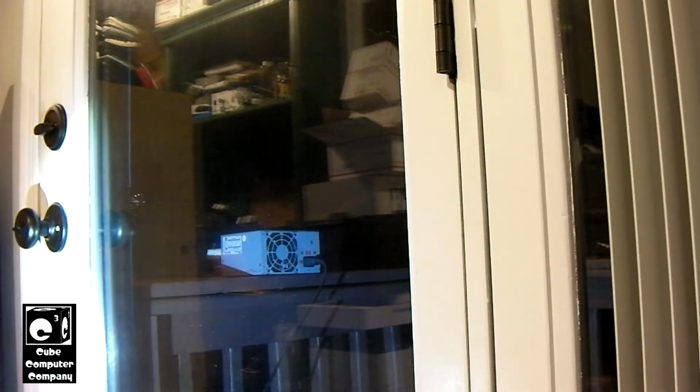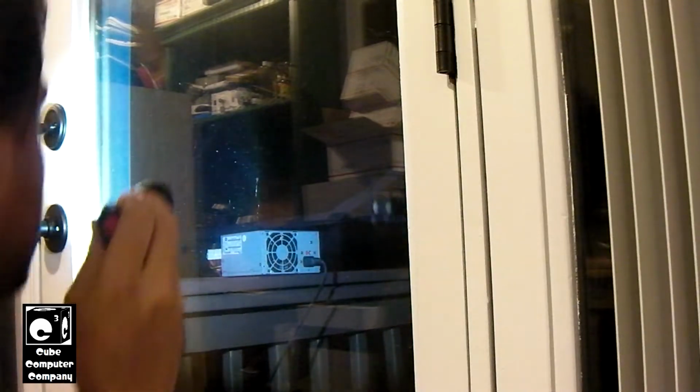Okay, everybody, it's on the back porch. It's plugged in, not the power just yet, but a bit nervous for this one. Let's see how it goes. Nothing at all. Yeah, there's definitely more going on with this unit. I'm going to point the flashlight down this time. Alright, the primary does charge up. We're just not getting any 5-volt standby.